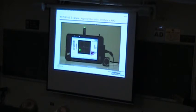And what this gives you in real time is an estimate of what that spot looks like. It's centering, and then the little vector is the average tilt. And so, between the XY center and the average tilt, you've got 4 degrees of freedom. And so if you have 2 turning mirrors, you can just steer in something really quickly. So by now, I never do anything in the lab without starting with that information, because it just makes things very easy.